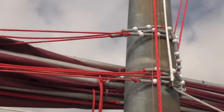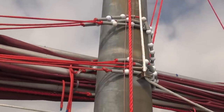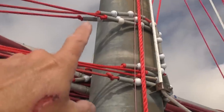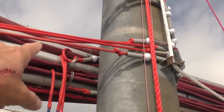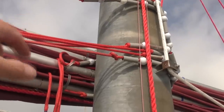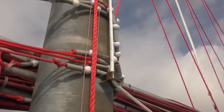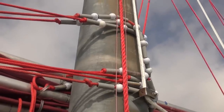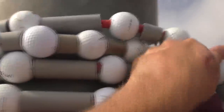Absolutely beautiful. Also think about putting a bungee strap up here — a lot of people talked about loops. I'm not ready to do loops yet but that might be a solution too. If I just had a little bit of elastic bungee between the outside edge, the parrel here, and back to the batten, it would keep these taught as they came down and stop them from overlapping each other. When it goes up it's nice if they're stacked in proper order.